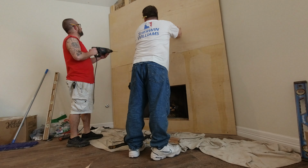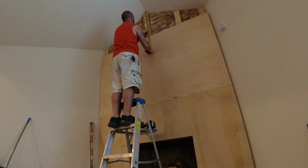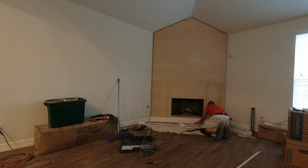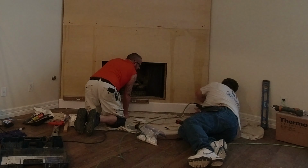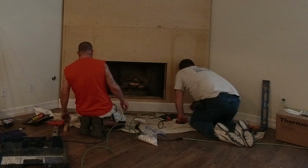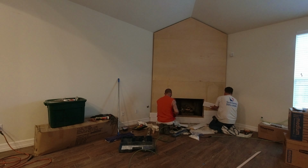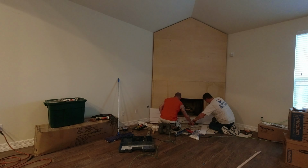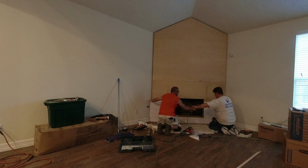After the second and third tiers went up, it was time to level up the first piece of, I think they call it nickel gap siding, shiplap, whatever it is you want to call it. It does have about a 3/16 gap, which is 1/16 more than a nickel. But again, with good prep, this material goes up super easy. A little glue on the back, stack it and nail it. I checked for level every few courses, but it was money all the way up.